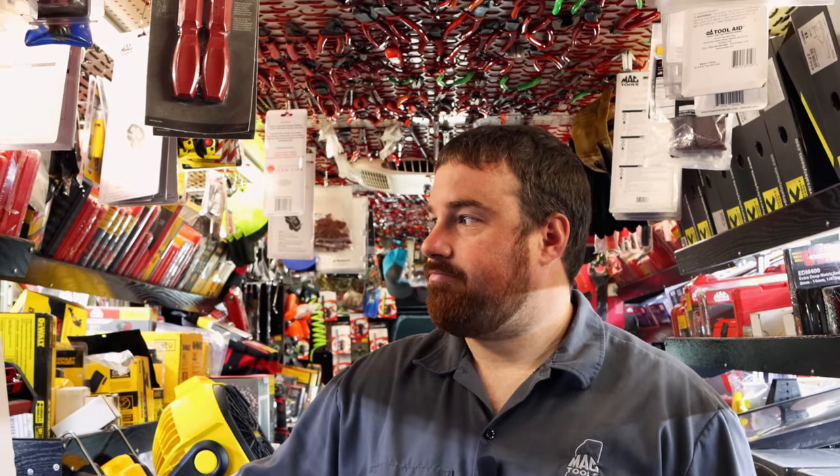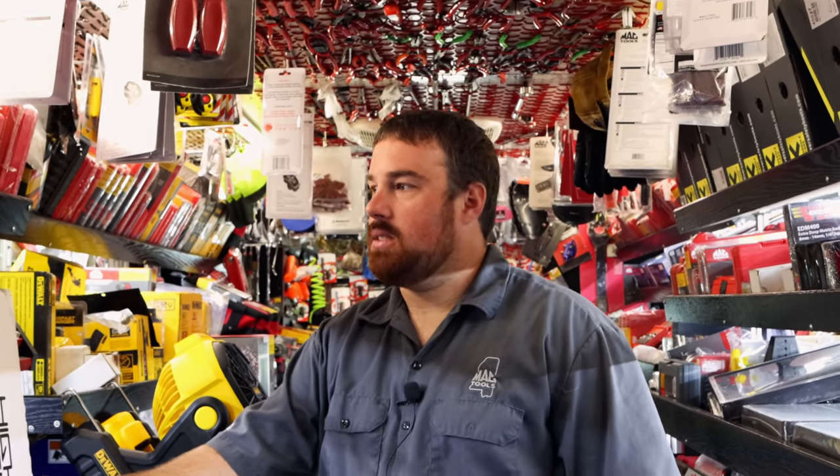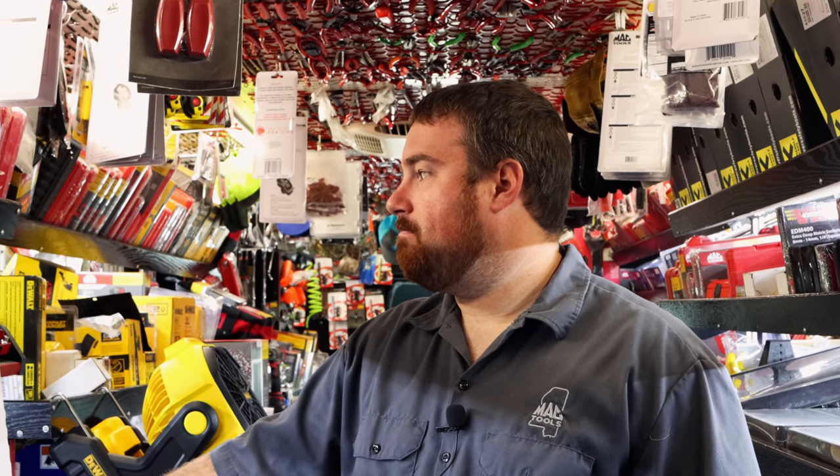I know the air comb bundle that was in the flyer this time — those things are super handy. And I did give guys a warning: if you get one of these, everybody plays with them, when they first put the air chuck in, it will get you. This is it right here — the red one, the 24-inch one, that's the one that's on sale on the flyer. Hold that joker with both hands. If you got a tractor or skid steer, grass is getting tall this time of year with all the seeds and everything. Those things are nice to blow your radiators and condensers out. And I like it on air filters too — like big trucks, especially the round ones like the KW's and Pete's 379 models. You can get in there and blow all that out, keep from changing your filter as much. Like a side-by-side, man, those little grass seeds will stop that radiator airflow completely.